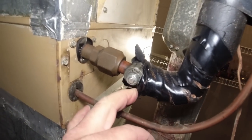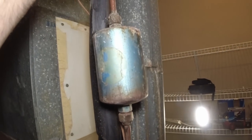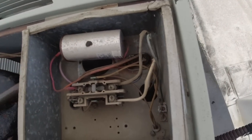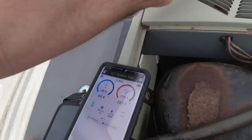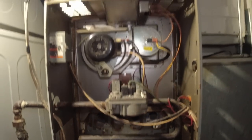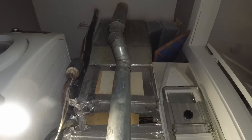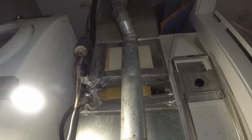I'm not sure what's going on here — the suction line's really cold, the liquid line's not even hot, it's definitely cold. Feels like it's flooded. We've got to go through the hatchway — there's an aluminum ladder up here. Going to check this one out on the roof. The subcooling and superheat were a little out of whack — it was overcharged. With the coil being dirty like that, it's not helping; superheat is going to be low with poor airflow.